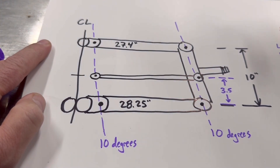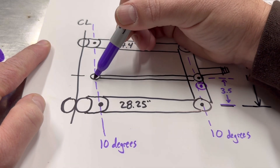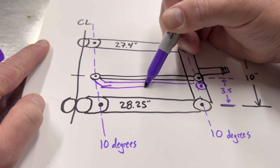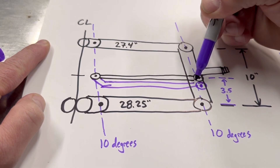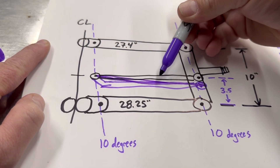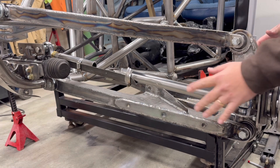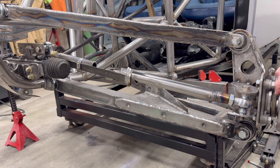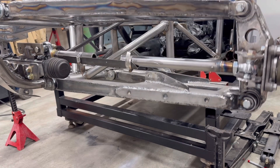Let me show a demonstration of what I did by accident. I moved this point down, then I got an angled rod end that put this rod right here. So technically this steering rod is still parallel to the lower A-arm visually. But these pivot points don't care what this shape is — all they care about is the line from here to here. So in theory, my steering rod is not actually parallel to my lower A-arm, and I think that's what's going on. Here's a demonstration of the bump steer I'm dealing with with the existing geometry. I'm not going to allow the spindle to move — watch the rack moving in and out. That is the bump steer. You can actually see the steering rod turning as the suspension goes up.